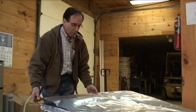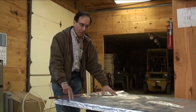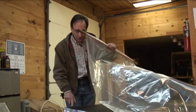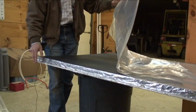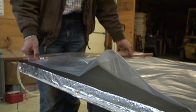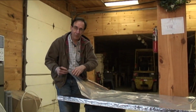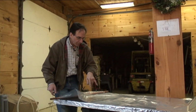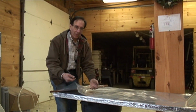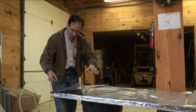In this one, we have water everywhere because it wicks out by capillarity. It sheets out in the entire absorber. And you notice it's clear. You can see right through it. And the aluminum facer on the insulation on the backside is painted black. So what actually happens in this collector is the sunlight comes in, passes through the bag, which has clear water in it, hits the black painted aluminum, makes heat because of that. The heat wants to radiate back up through. It's collected by the fluid that's passing through here.